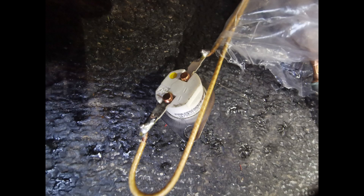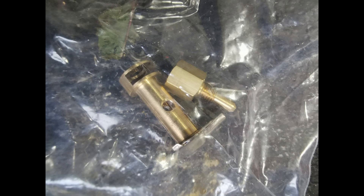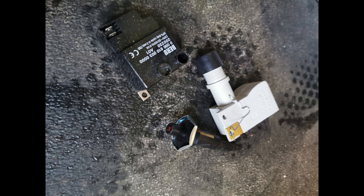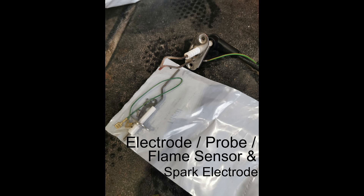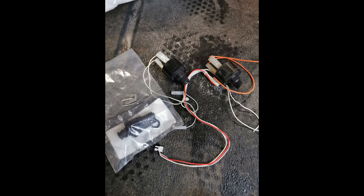This is the overheat stat. Here's the pilot and pilot injector. This is the spark generator - there's a push-button one here that can also be called a piezo igniter. The thermocouple is found on older boilers. And here are the electrodes - there is a flame sensing one and also an ignition one.